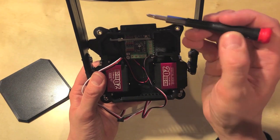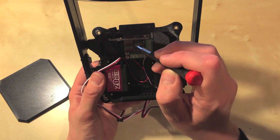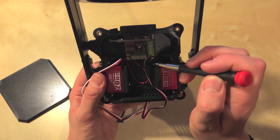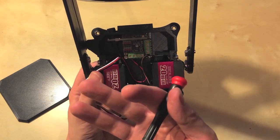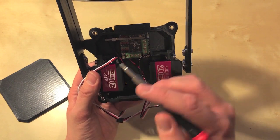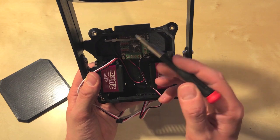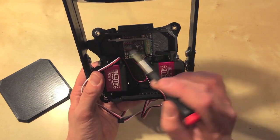There are a couple of problems with this setup. The first is a bit of a niggle: for some reason a little bit of the USB power goes into the servos, which means you can never turn the servos off completely. That's a bit annoying — I assume it's because they expect you to be using small hobby servos, where powering them off USB might be useful. But that's no good for us because we're using these big powerful ones.